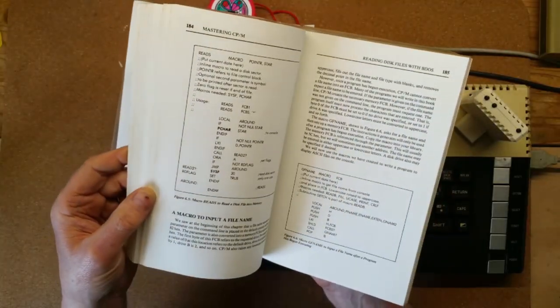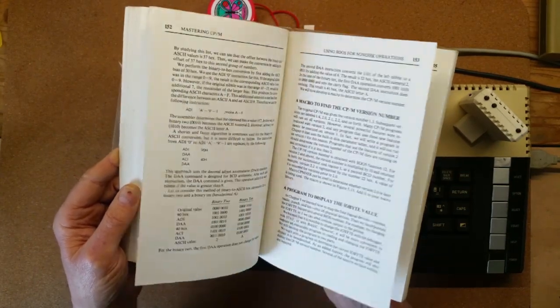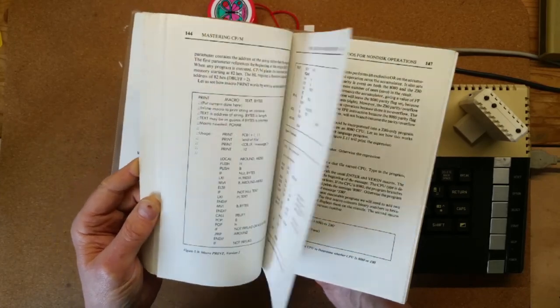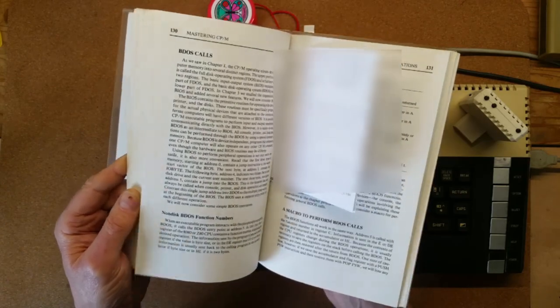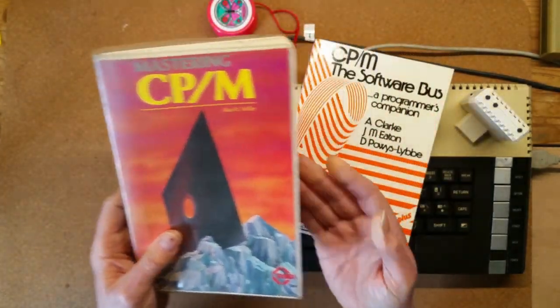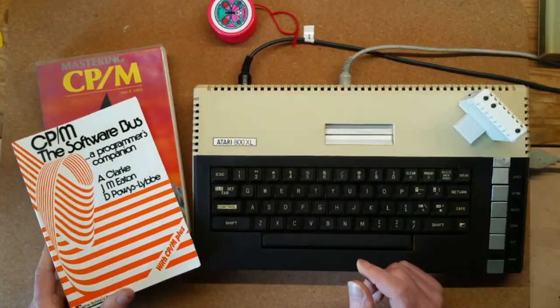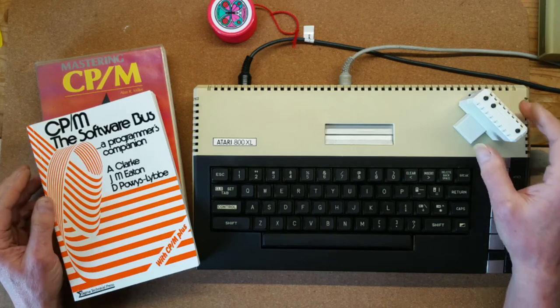The easiest way to get started with CPM is undoubtedly with Fujinet. This is a little device that plugs into the SIO port of an Atari 8-bit and emulates a number of peripherals such as the disk drive, printer and modem. It can also connect to your Wi-Fi where it will enable your Atari to download and boot software directly from the internet. Fujinet is based around an ESP32 microcontroller and an onboard microSD card.